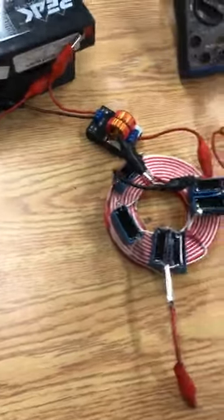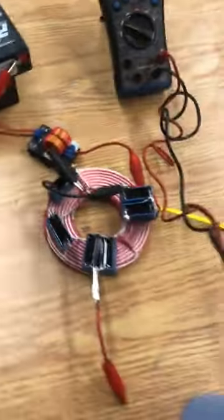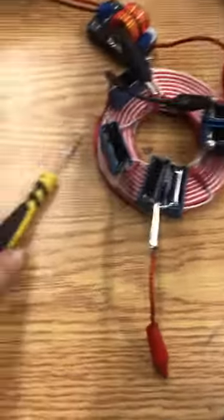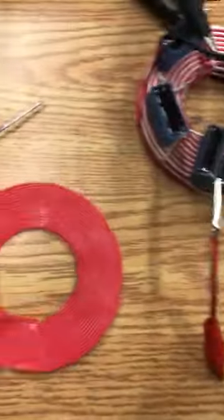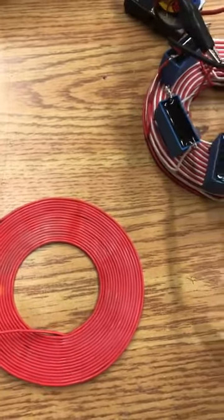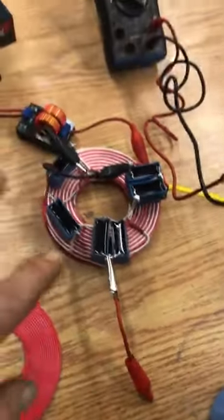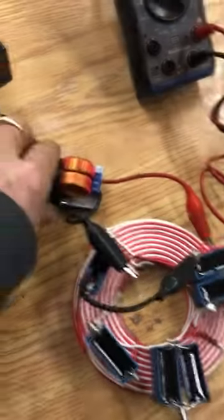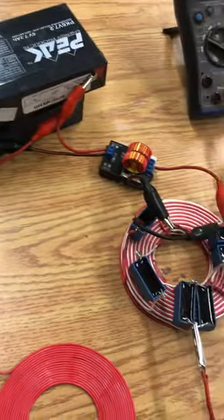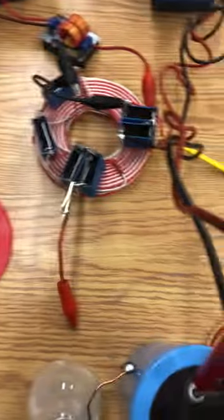I have this hooked up. I'll go over the system here. This is the regular unit, the compact unit. I have another primary like this on the bottom — this is a 16-foot primary. The device does not work the same with the ZVS. This is just a little 5-volt ZVS running off of 12-volt battery — well, two 6-volt batteries — but they are weak, so there's much less than 12 volts.